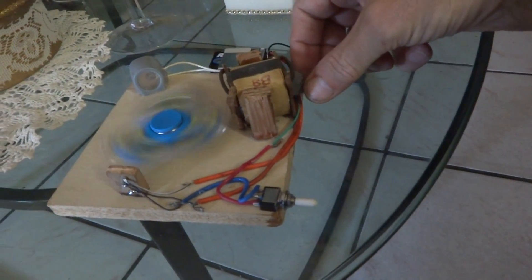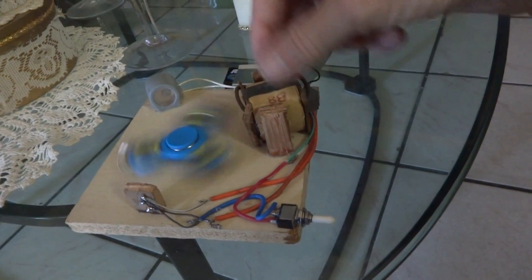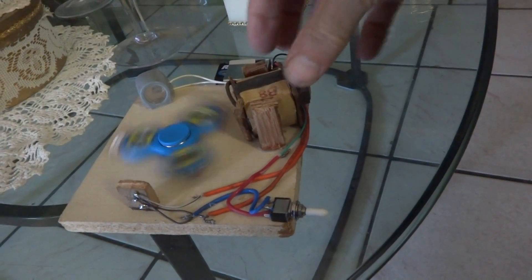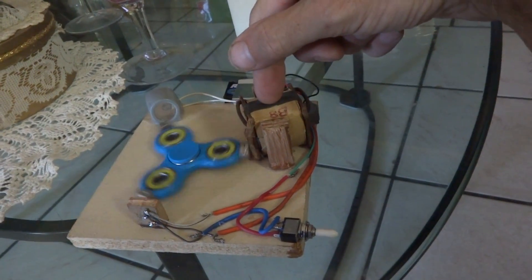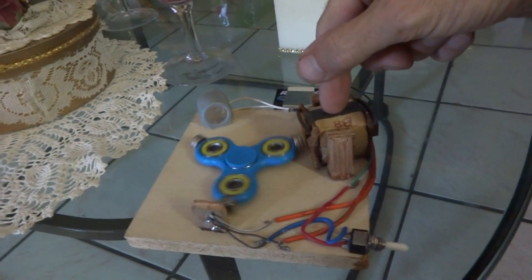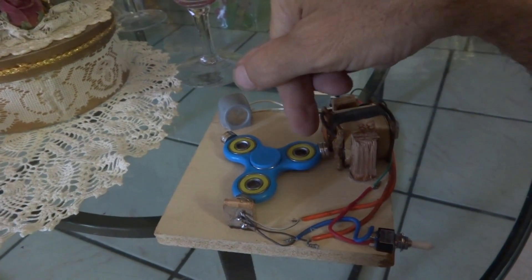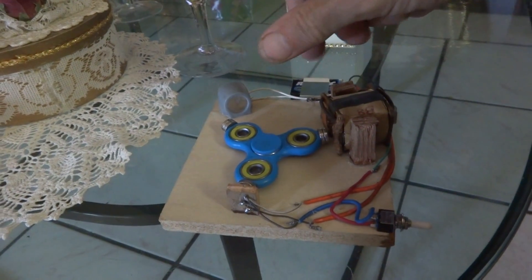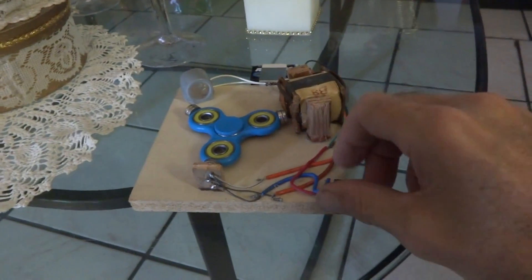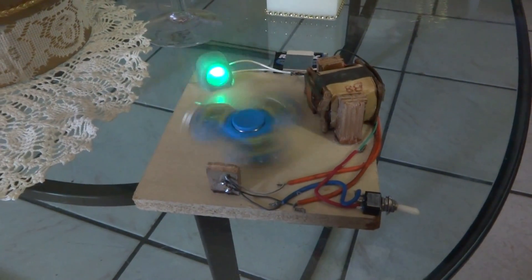In this coil I took the core from another coil that's a little bit smaller, because the one that came with this initially was gigantic and I didn't want one quite that big. I have it pushed in about 60 percent. What that does is it strengthens the magnetic field without getting the metal part too close to the magnet, which would add drag. So you balance those out and it actually strengthens the magnetic field without adding drag.